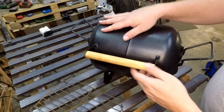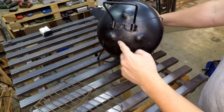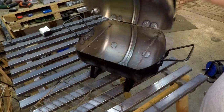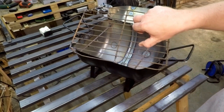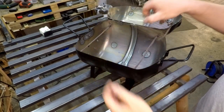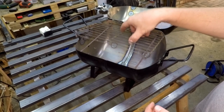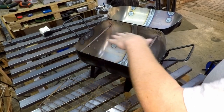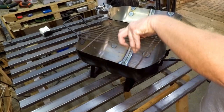Here's the final product. The handle in front has a light coat of varnish for protection. On the sides I've drilled a bunch of holes on both sides for ventilation for the coals at the bottom. On the inside I welded two supports for the grill. For the grill itself I used an old barbecue grill which I cut to size - the four corners are bent over and welded into place so they fit the oddly shaped cylinder. The bent corners also keep the grill lifted off the countertop, which is quite handy.